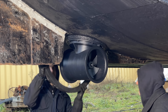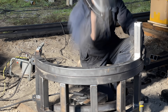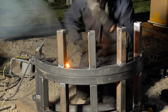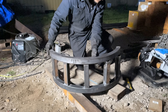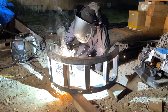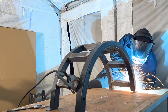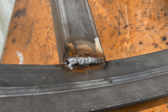Now let's put parts of the cage in place to see where we are so far. The plan is to bolt the cage onto the hull rather than welding it, so that it can be removed easily in the future. I use the first cage as a template to get the proper layout for the struts on the second cage. Now I can put together the second cage — not all the struts are perfectly parallel to each other, and in some areas the gaps may be larger than in others, but for the purpose I'm building them these deviations are perfectly acceptable.